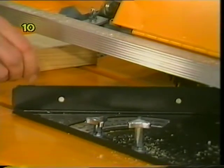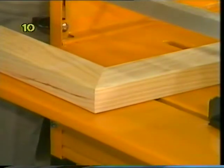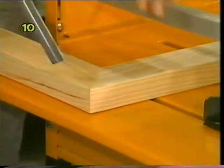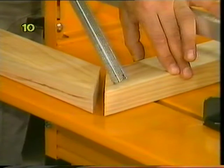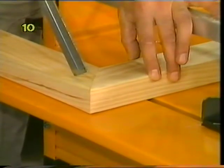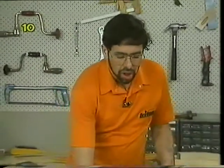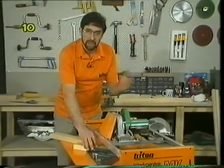If it wasn't quite correct, you'll have to make a very slight adjustment in the setting of the mitre gauge by loosening the front knob. Make tiny adjustments, because what you've got here is an off-cut being placed against the main piece. If the gauge was set in error at 44 and three-quarter degrees — a quarter of a degree off — you're doubling that error because both pieces are 44¾. Twice 44¾ is 89½ degrees, so a quarter degree of setting error results in a half-degree of cutting error. After each adjustment, do a shaving cut on both pieces to make sure you're treating them the same way.